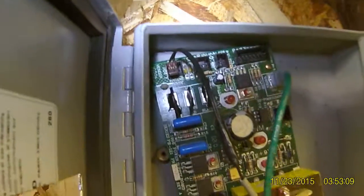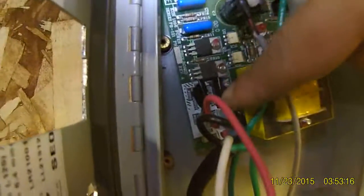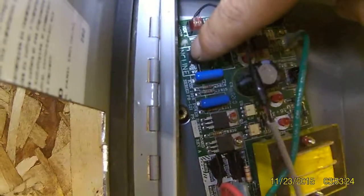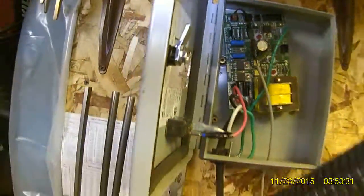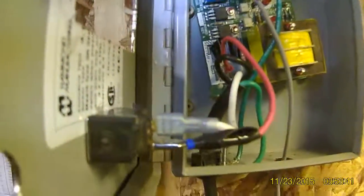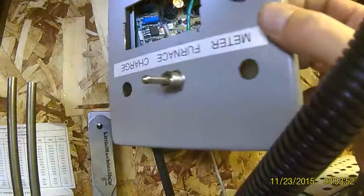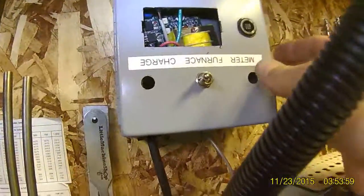One of the connectors, if you use this for something else, is your potentiometer control. I put tape over the AC pins because both of those are hot and I don't need to forget to unplug it and stick my fingers in there someday. It's not complete protection but it's better than nothing. I wired a toggle switch in line. I used this box just to keep it up here and keep the dust out. It was a lot better than using another box, and it has a hole in the front that'll allow some heat to dissipate.